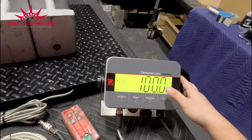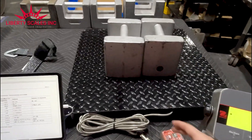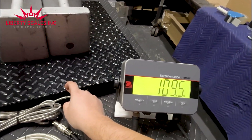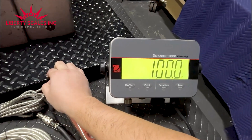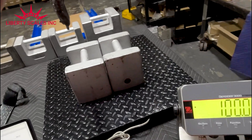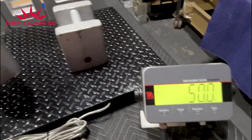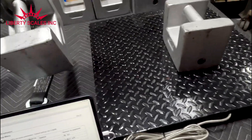The indicator then asks about linear calibration — calibrating in steps — but I press no. Geo settings: no. When done, I press the menu button to return to regular weighing mode. I test the scale: it reads in half-pound accuracy. I press down on the scale and release — it reads 100 pounds. I remove the 50-pound weight and it correctly shows 50 pounds.